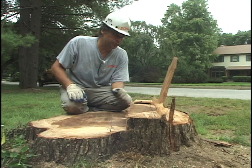But what you often don't want to do is make that plunge cut below the floor of the notch. That creates a situation where you have to put a lot more pull on the tree to get her to go. In logging scenarios, they recommend a 2-inch stump shot, or a 2-inch differential there, making that back cut 2 inches higher than the floor of the notch. That is not necessary in almost all suburban situations.